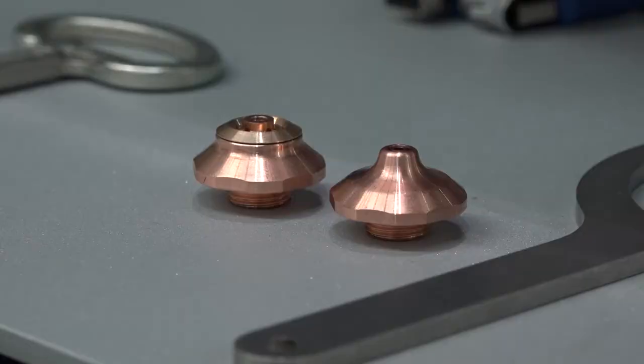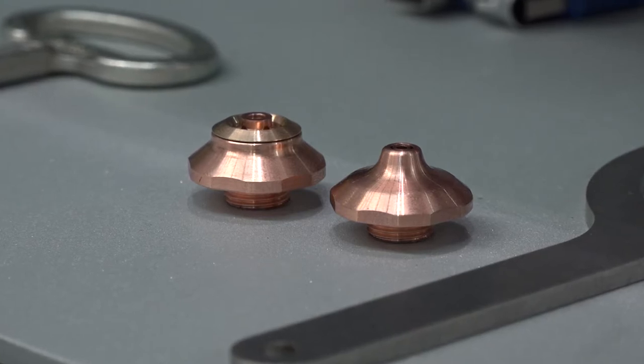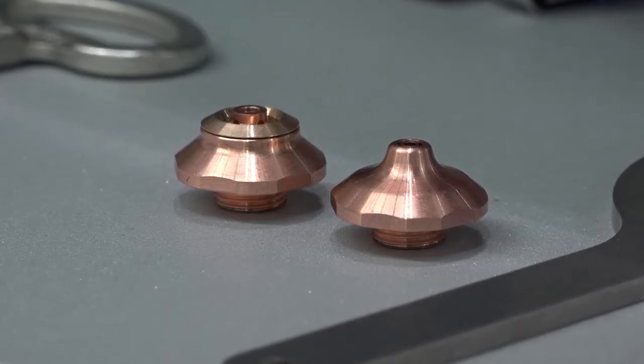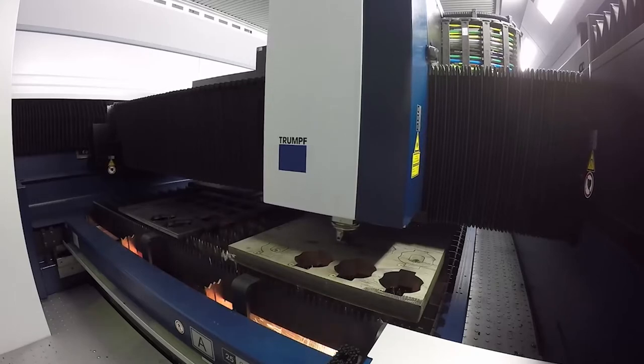It increases your output over a certain range of materials by as much as 100 percent, so there is a huge innovation — come and see it at open house — when cutting with nitrogen on stainless steel and mild steel. Are you the only ones doing this? We are indeed. There are quite a few patents on this technology, and it was only recently released at Intech in Germany about four weeks ago. New technology, hot off the press — economical and efficient go hand in hand with the solid state disk: less gas, more parts per hour, cheaper for the customer.